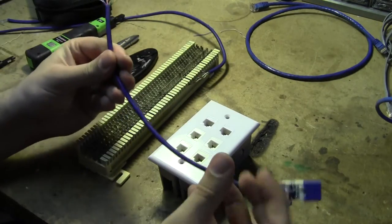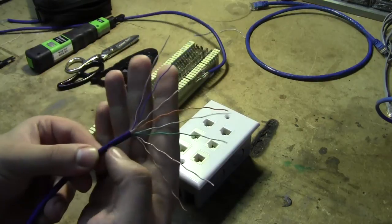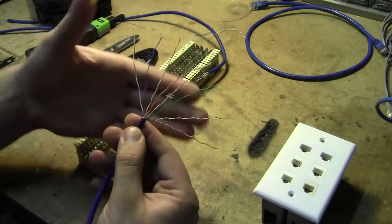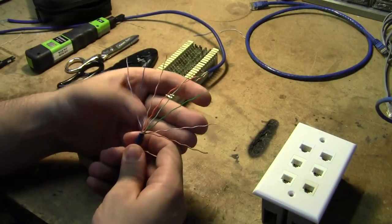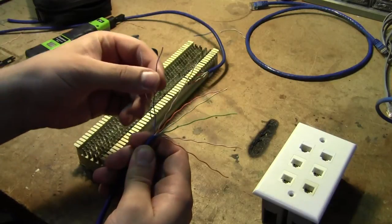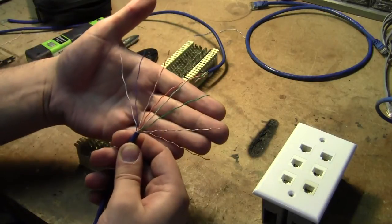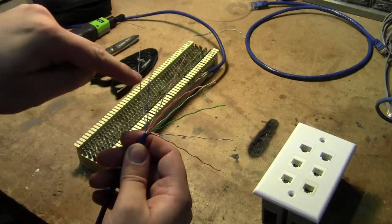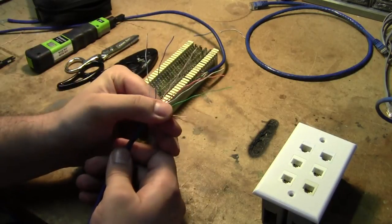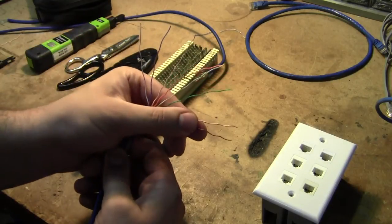What I have is this sacrificial cable with a free-floating female RJ45 on one side and loose wires for the first, second, third, and fourth pairs. This is actually the first four pairs in a 25-pair sequence. The first five pairs all have white in them and go through blue, orange, green, brown, and slate — we only ever see the first four here. So: white-blue/blue, white-orange/orange, white-green/green, white-brown/brown.